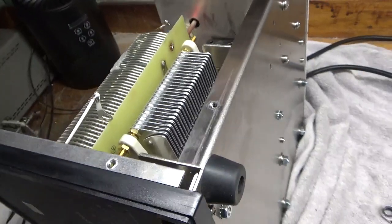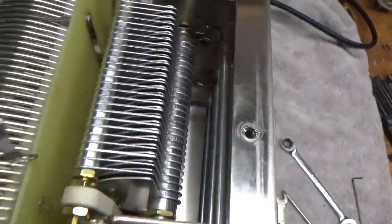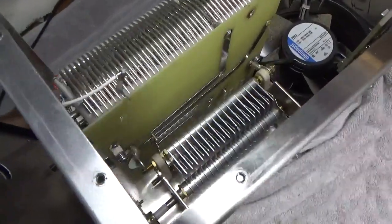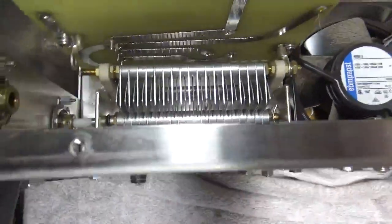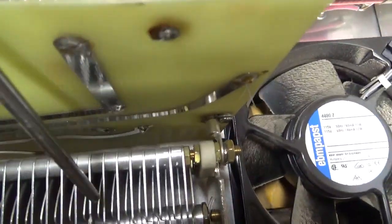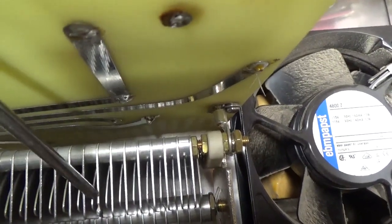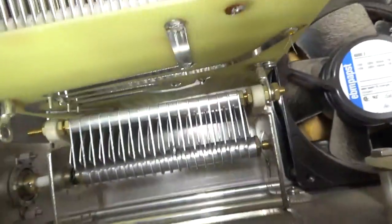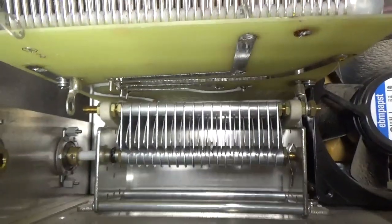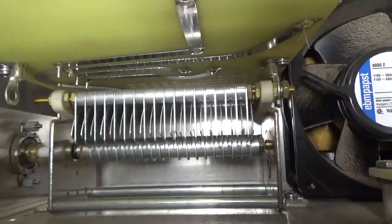I'm going to go ahead and remove everything. I'll show the damage to the capacitor, and then I'll reinstall it all. The load air variable's been removed. You can see the damage to the plate cap right here where it's all melted — it's too far gone to try to repair it. So I'll go ahead and remove that, just like I described the removal process for the other one — same steps to get that one out.